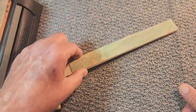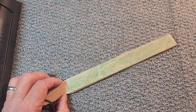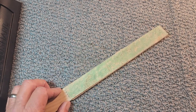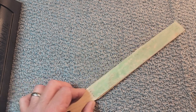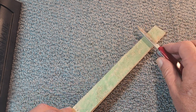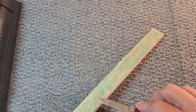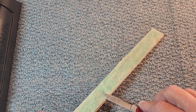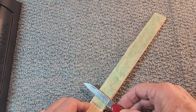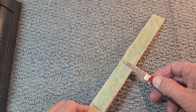I think my last step on this main blade here is I'm going to try to use this stropping stick that J.O. Ventures made for me and sent to me. He had it preloaded here with some compound on it. I'm not the best at stropping. Not sure exactly how to do it, but I've been trying to practice it here just a little bit. My understanding is you just kind of let the weight of the knife work on it there. Don't necessarily put any pressure on it. You're just trying to knock off any of those little tiny burrs and such that you might still have. So we'll give it a few strops.